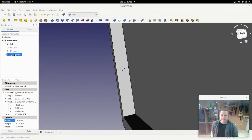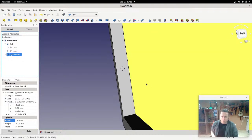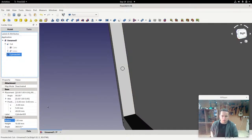All right. So the reason you might want margin here is if you want to be able to put the LED in and take it out, then you'll need a very, very slightly larger space than exactly the size of the LED. Or if you trust your printer to be exactly right, you could have it the right size. If I'm mass manufacturing, printing out loads and loads of things, then I don't want to have to do any post-processing, which means I want the hole to be right from the beginning. So I would introduce a very, very slight margin to the radius.